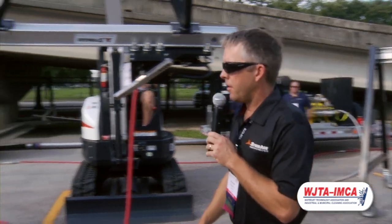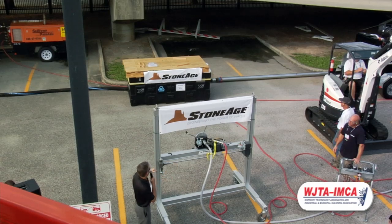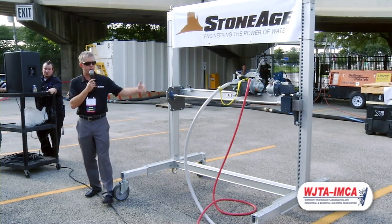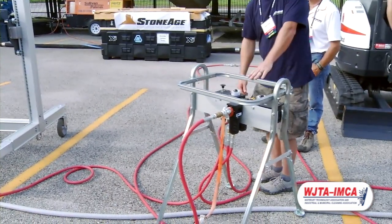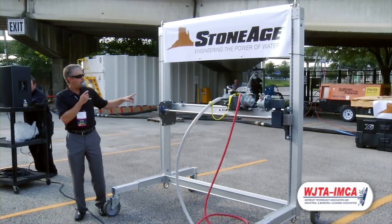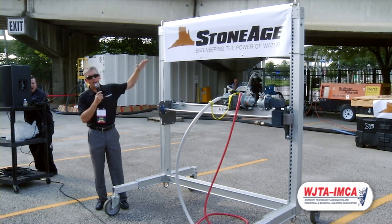The next exhibit is our XY frame. Many of you folks are familiar with our rigid lancing machines. These supports and frames are all that same technology, so many of you already have a lot of this equipment — you have the control panels, you have the rails, the support wheels or stands. And now we're taking that blast track and putting it in an XY frame. The XY is a reference to the axis that we're going to clean. This blast track will again go back and forth automatically, and then the operator can also adjust it up and down.